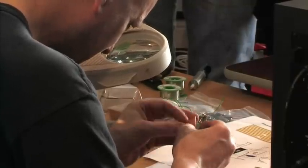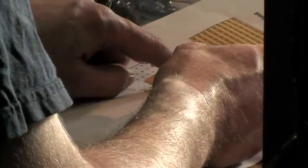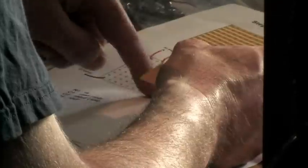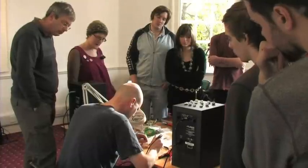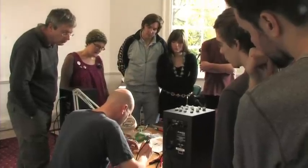Way back in January I'd had a rough idea about doing the Atari punk console, or step-tone generator, but making a more interesting instrument out of it by adding extra circuits. So we built an Atari punk console, then added a fuzz circuit for distortion and an amplifier to boost the signal and clarify it a bit, and a five-step sequencer to get rhythmic stuff out of it.